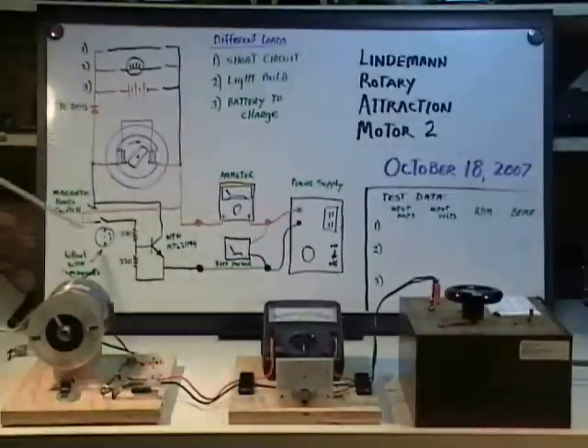That control mechanism is also very simple. It consists of two 220 ohm resistors as shown, creating a little voltage divider bridge, which is connected through a magnetic reed switch — this brown box here. We have a wheel on the motor with two magnets in it, and that is this wheel in front here, with the magnets here and here.